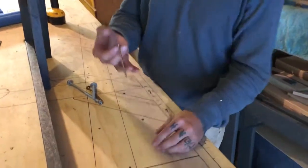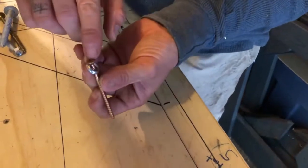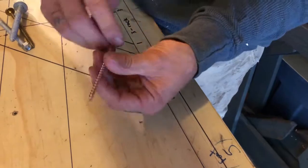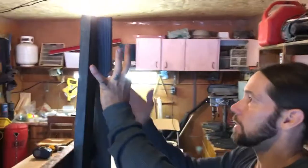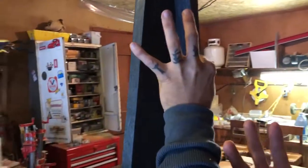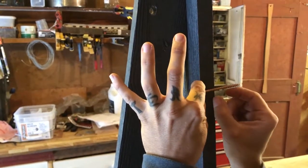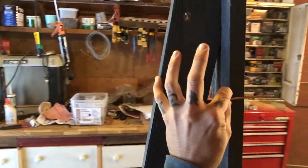This is just a standard deck screw. Now they come in obviously different lengths, number 2 bit, number 2 Robertson bit, with a washer on it. So again, this is strong enough for any application. And again, you're drilling it straight through into not drywall, not something soft. You want to make sure you ideally could hit a stud in a wall, would be perfect, or a thick plywood, you know, or you might have heavy wood siding on a boathouse. That'll work there.